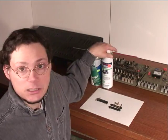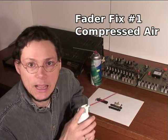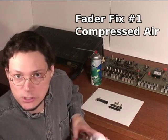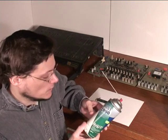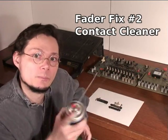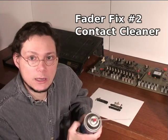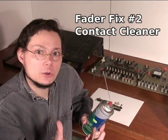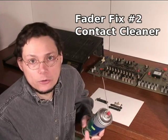One of the most common issues with the ARP Odyssey is dust and dirt accumulating in the faders or sliders. This can cause notes to become unstable, sound scratchy, or whole sections simply not working. There are four different ways to solve that problem, from the least effective but simplest to the most effective but most difficult. The easiest is to use compressed air in a can and spray it right into the faders — you can do this without taking the circuit boards out of the synth. The second way is to use contact cleaner instead. Be very careful not to overdo it, and avoid any contact cleaner that includes a lubricant, because the lubricant will attract more dust and debris, and a few weeks later you'll be right back where you started.